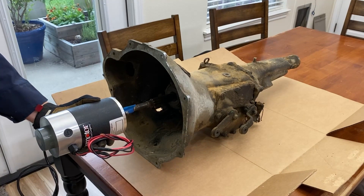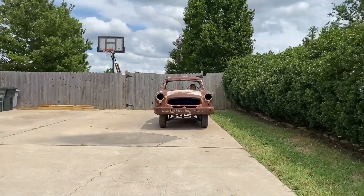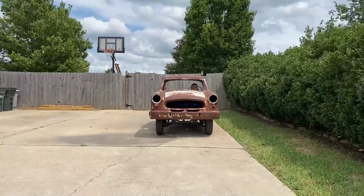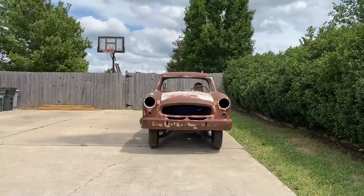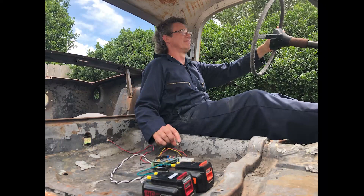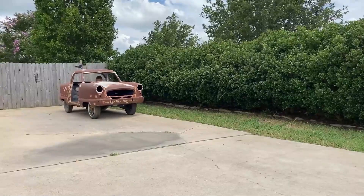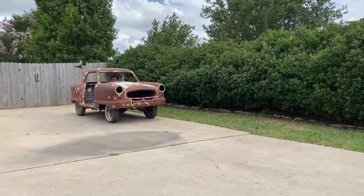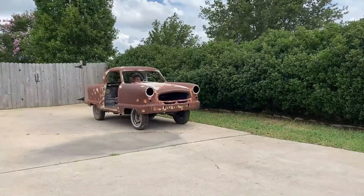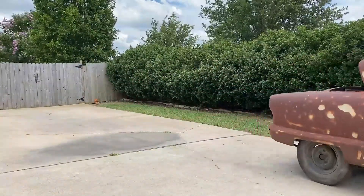Speaking of torque, I'm using a very undersized brushed DC motor running at 80 volts. I'd upgrade to a larger motor, preferably running over 200 volts. Therefore, I'd also need to upgrade the servo amplifier to a proper high voltage and high current controller. These are available on the market for DIY applications. And while it is amusing to use batteries from my electric chainsaw and I can easily pull them out to charge, my range right now appears to be a couple hundred yards. I live 18 miles from work, so I would likely construct a battery pack from cells pulled from a Tesla, or Bolt, or similar.